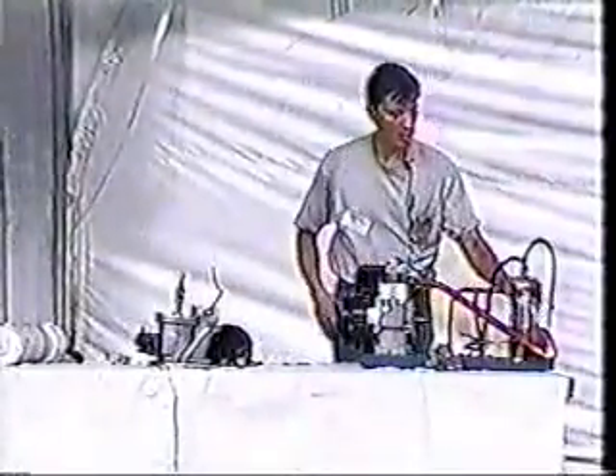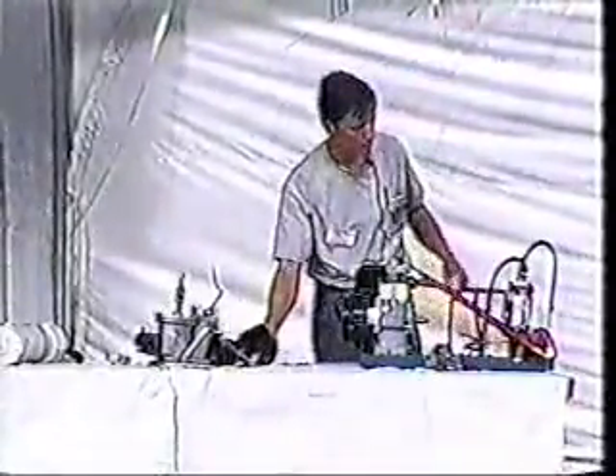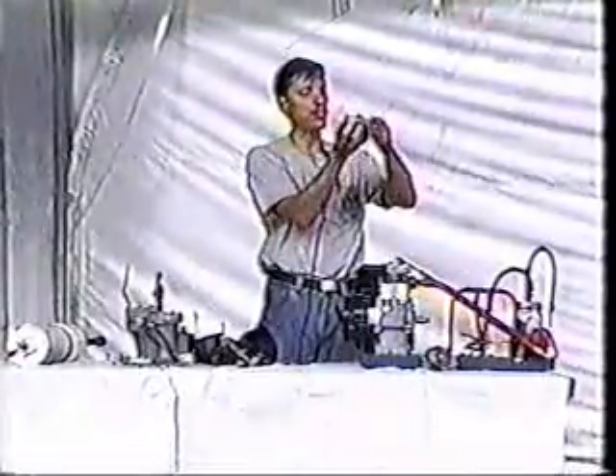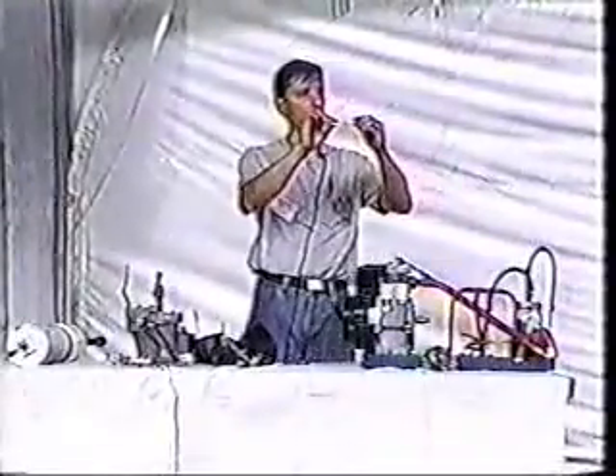Let me just rehash everything. We're going to bring air in — like in this bubbler it comes down through this big pipe and then diffuses underneath the plate. Here we've got a steel tube that runs down and discharges the air where it bubbles up through the stainless steel wall. The plate should be just below the surface level of the fuel so that the big bubble comes up, hits the plate, works its way around and up through. I prefer just a little bit — maybe a quarter of an inch — under the surface level of the fuel.